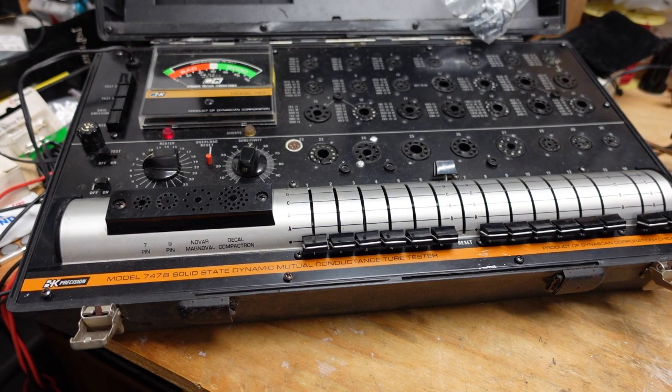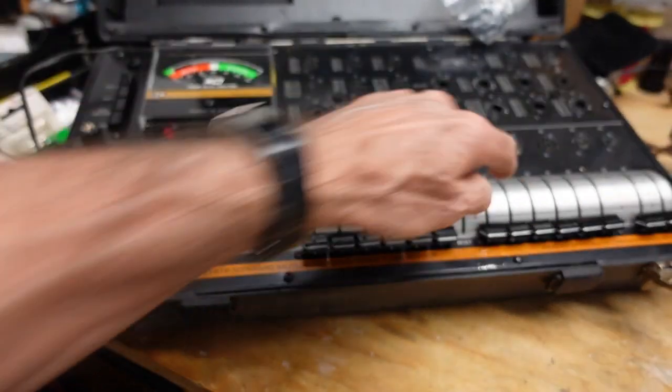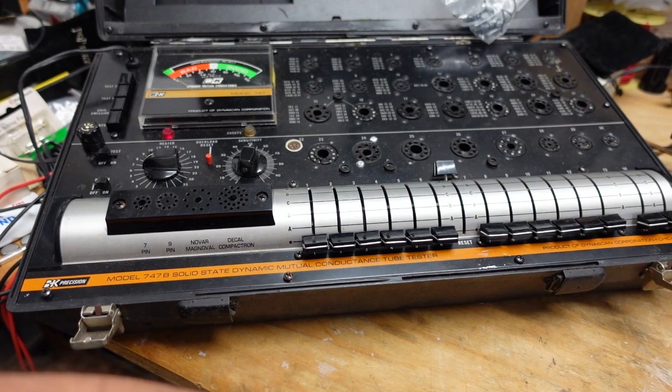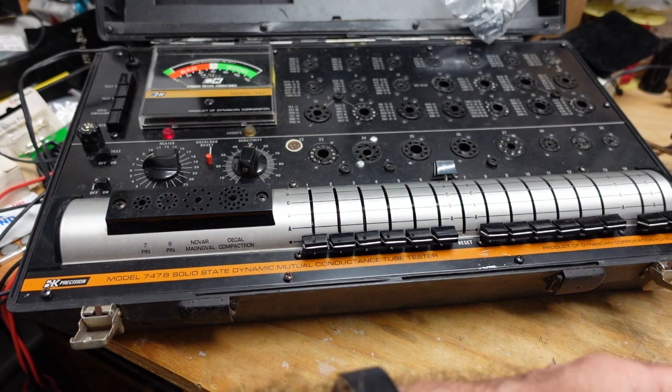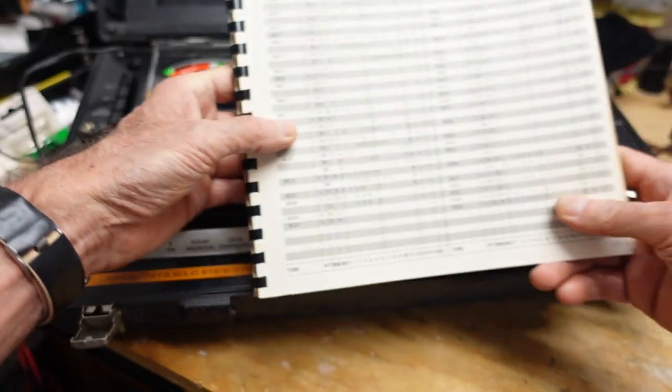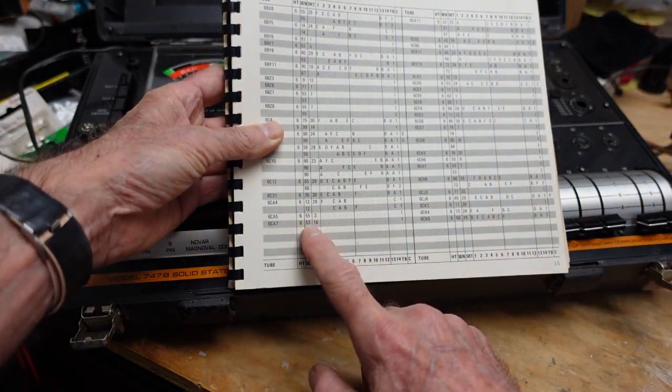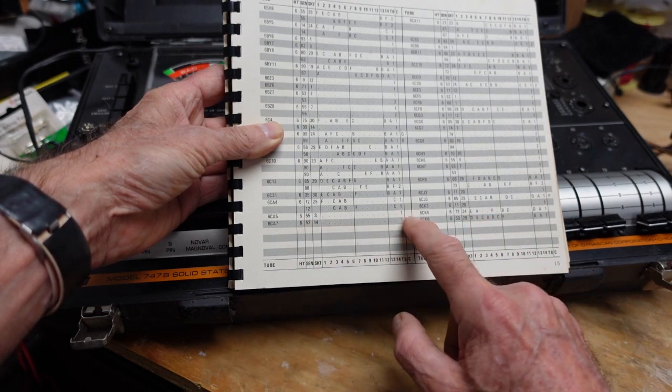But anyway, we need to look up the tube so we can set all these selector buttons, and this is an EL34 tube, which has a cross reference in here, but it's just going to tell you it's equivalent to the American 6CA7. So let's find that. Okay, well, that makes life easy because the 6CA7 tube has no settings here.